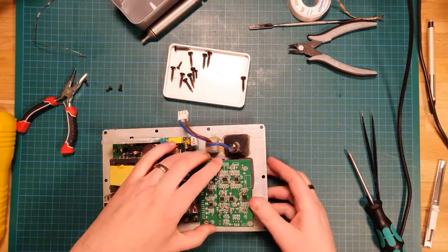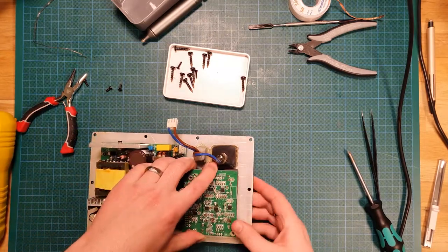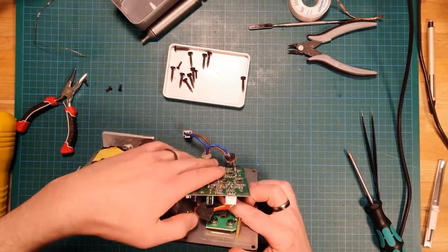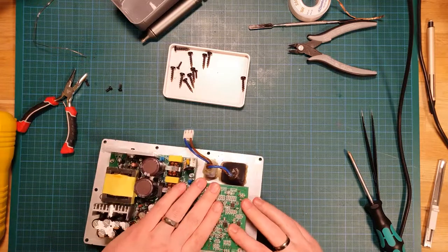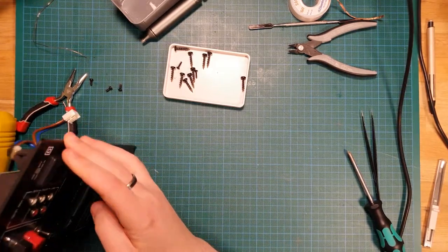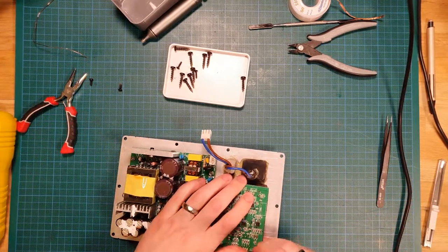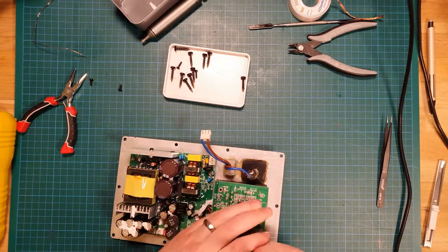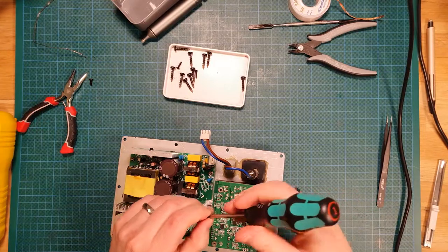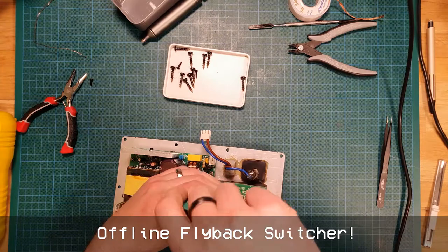Yeah, like I said, I happened to find one. So that was very fortunate of me. Definitely can't use this as a guide to repair these in the future because I don't know what I did, but hey, if you have one of these and you want to try to figure it out, maybe look for dead shorts. I mean, the completely cracked in half power transistor, that was a flyback transistor? It was definitely a giveaway of something wrong.